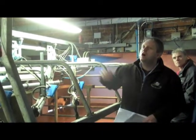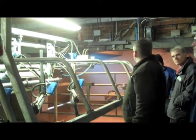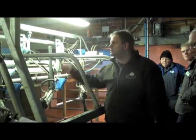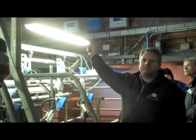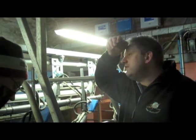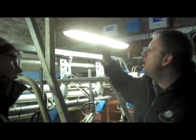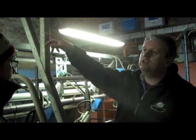There are things you can do, and we're about right on this farm. Obviously in the parlour where you need a lot of light, he's got his fluorescents. These are what's known as T8 fluorescents. They are basically old technology now. You can get fluorescents that look exactly the same, give just as much light out, and they will only consume half the power of these.